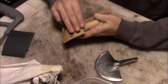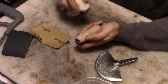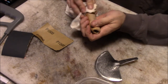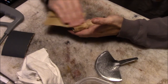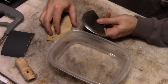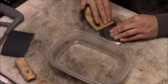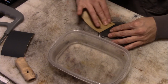Back at the bench it's time to do some hand sanding on both pieces. A trick I learned from doing gun stocks for muzzleloaders is that you sand the wooden piece and then wipe it down with a wet rag. All of a sudden it will start to feel rough again as the sanding dust is wiped away and comes out of the pores of the wood. You just keep wetting it down and sanding until it feels smooth even after you wet it. You'll get a really nice finish that way. On the metal piece, same thing — just keep polishing until you can't see scratches from the previous grits.